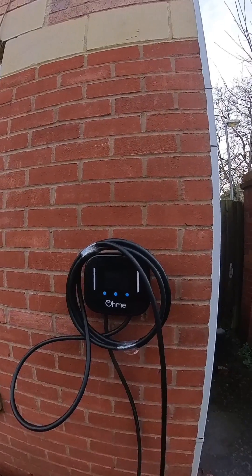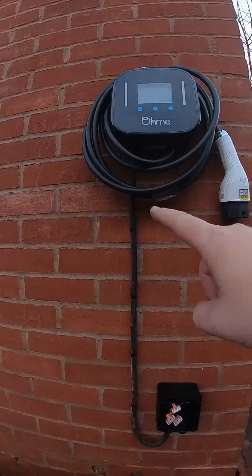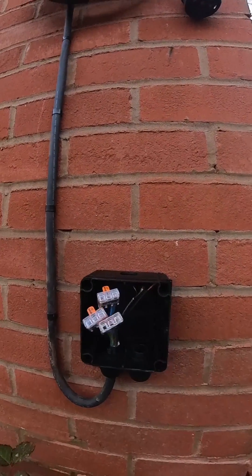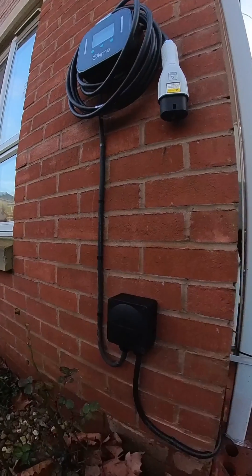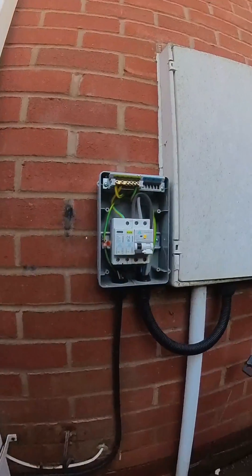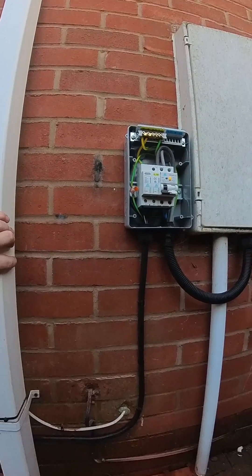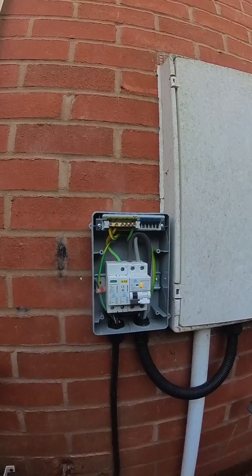We'll get that connected up at the bottom and get some more images so you can see what's going on, then get the cable clipped around. Charger cables are clipped all the way down the wall. We've looped into the bottom of a Wiska 607 box with a couple of WAGO 221s ready to go, and we're taking our EV Ultra cable out the bottom, around, and up to the IP rated board. The EV Ultra is being clipped around the side of the building using linear clips — we tried D-line clips recently but they didn't look as neat and using them with the spit gun wasn't great either.